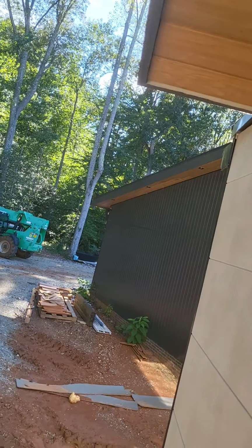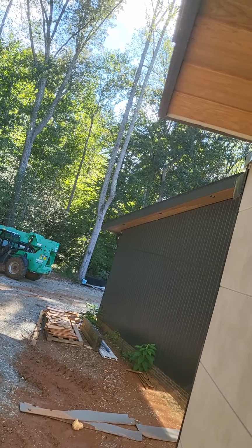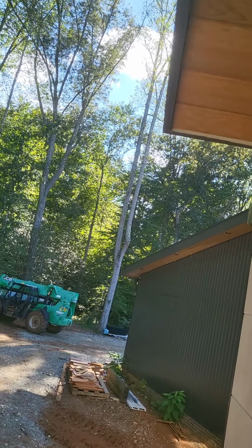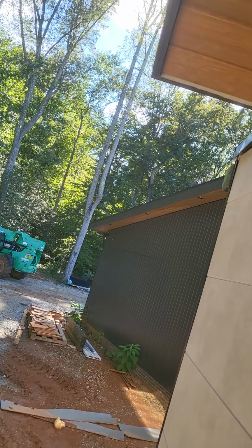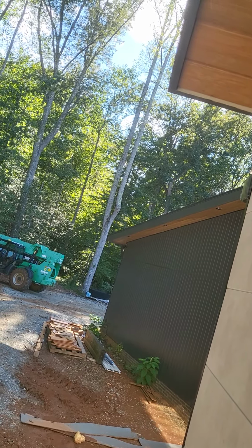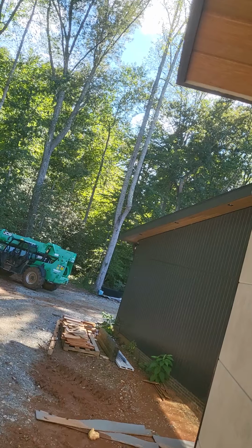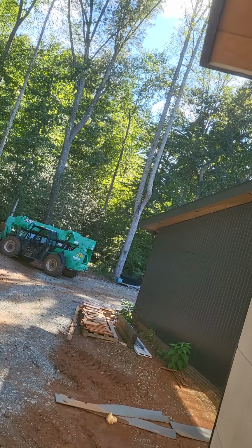Hunter and Doobie have been over in that attic for 2 days. They didn't follow the plans at all. No mechanical fasteners, no hangers, no hurricane tie downs. I mean, that entire fly rafter, get the right gust of wind, it would just blow the whole damn thing right off the side of the gable. Nothing holding it down. No mechanical fasteners anyway. Some air nails, I guess. Haven't even started looking for those.